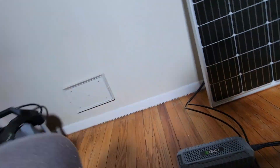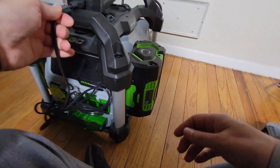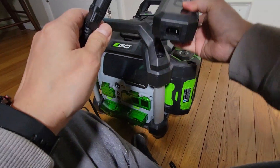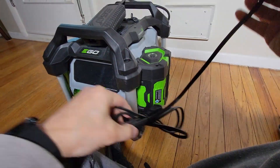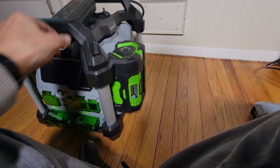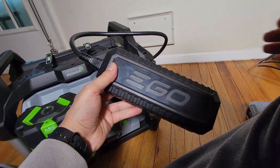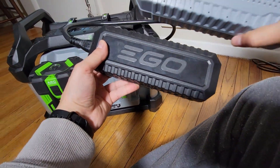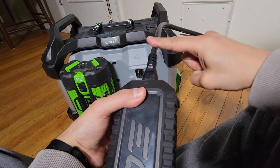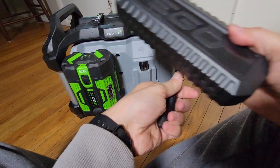Now I'm going to talk about the cables that come with your power station. You want to take your charger and take out the charging cable itself. This wall plug cable — you do not need it. We're not plugging it into the wall, so just put it aside. We're going to take the 170-watt transformer and replace it with the solar adapter. You do need this other cable. Go ahead and unplug it, wiggle it out, and put the transformer aside.